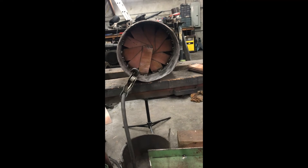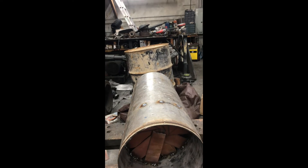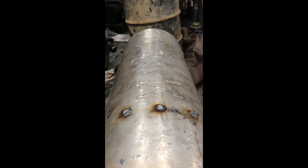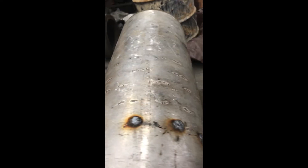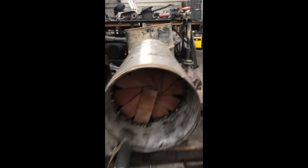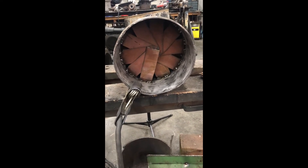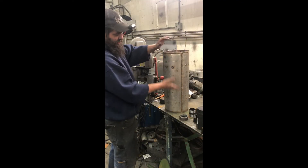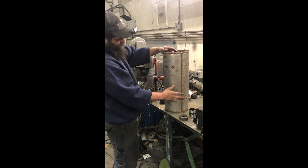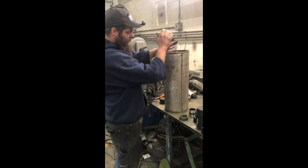That's about what it looks like. I still have quite a bit more to go and still have the other side. You can see maybe three-quarters to an inch in between each row, and you can see all the heat spots where I've been welding down. Yep, this takes a while, but all we're doing is creating air turbulence — it'll preheat in there. The bottom two-thirds is completely full of fins and ready to go. It's ready to have its cap put on.